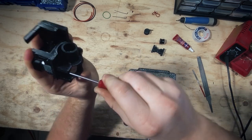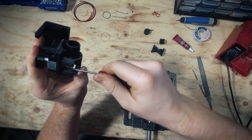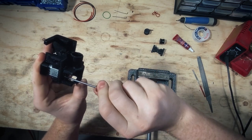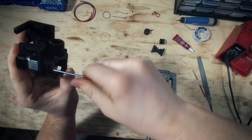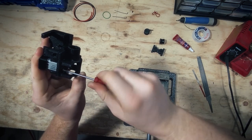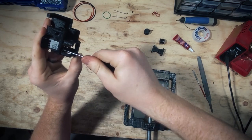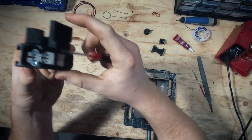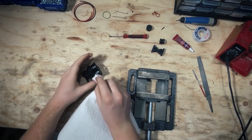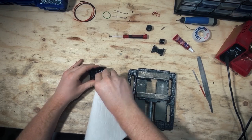A trick I like to use is to almost push through the plastic and then start turning as soon as I get close to the motor. Make sure the shaft of the screw is going straight down — the screwdriver may be straight but the shaft may not be, so play with it and try different directions. Apply good pressure and you'll feel the screw grab the threads in the motor. Then bring it to a good hand tight — nothing ridiculous, just flush with the plastic. Dab out whatever's left of the loctite with a paper towel.